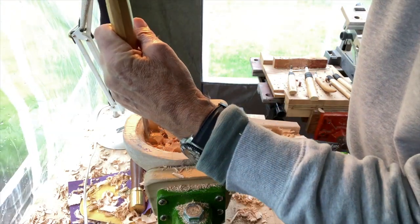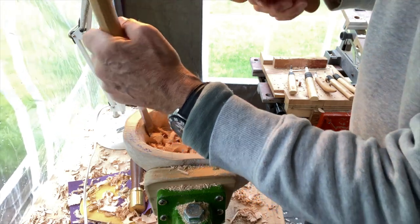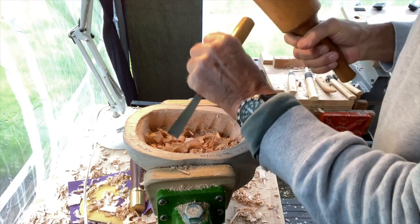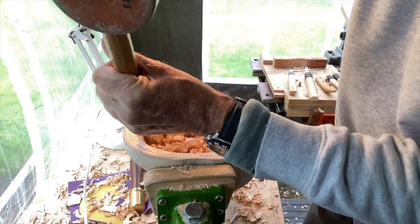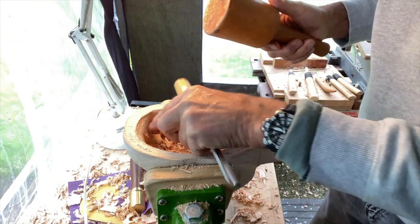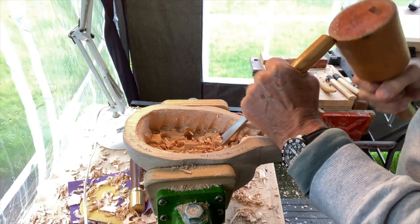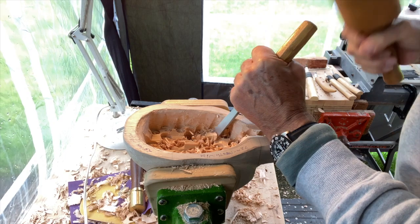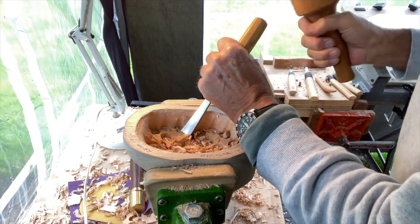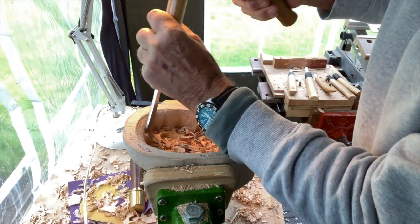The thing to remember when you're working with chisels, and particularly on a piece this size, which is considered fairly large, is that it's more than a whittling project. You take off small amounts at a time. Don't try and take out huge pieces at one time. It's better to go a little here and a little there, and just keep tapping away and chiseling out the extra material.